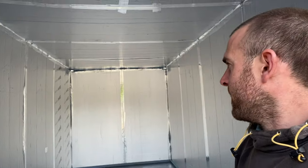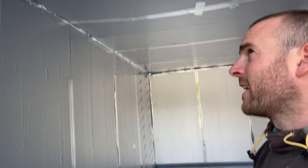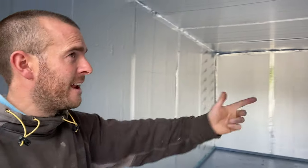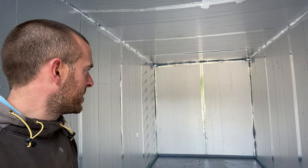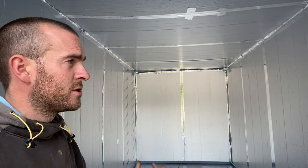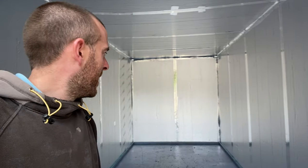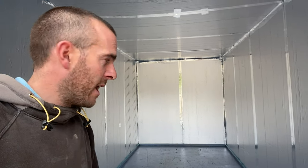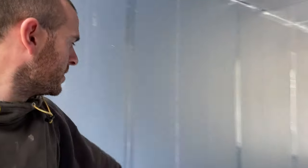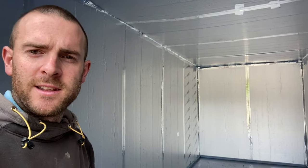I don't think I'm going to clad this up in plywood at this stage, because I'm only going to use this for storage. But if the use were to change, I'd probably do the extra cladding with three-mil plywood — I'd glue it, stick it on the side, and just put small screws in. Once the glue sets, that's it. These modern glues are pretty much better than screws.